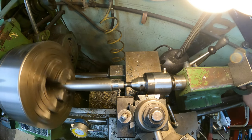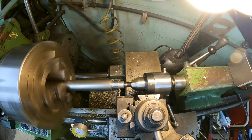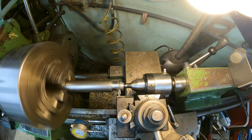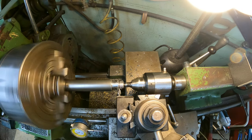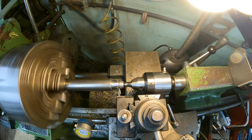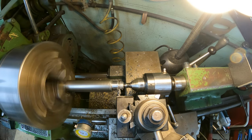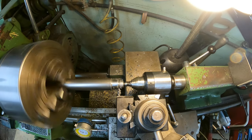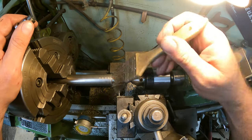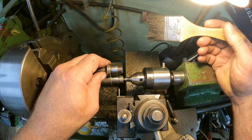This one is deeper than what the other one was. It is 83 thousandths deep. And there's our 80. And the same thing, we are going to come over here, and we're going to move it over 10 thousandths or 12 thousandths and then cut just that edge off. Just like that. And you can see, I mean, we're starting to look like what this part is.